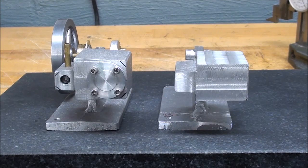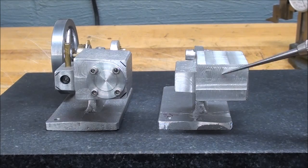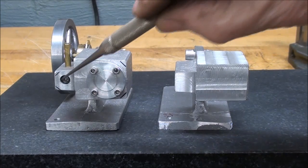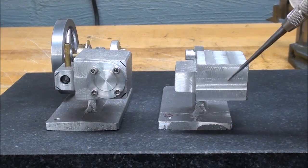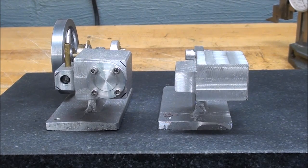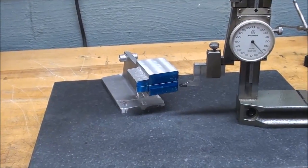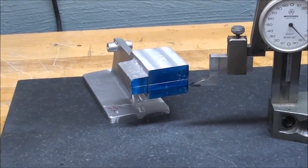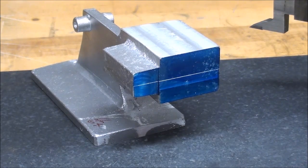I'm changing some of the dimensions just slightly over the original. This has a 5/8 bore, and this will have a 9/16 bore. This is a quarter-inch valve, and it'll remain quarter-inch. So now I'm going to put some layout die on the end here and lay out those holes to get ready to drill and ream. If at all possible, do much of your layout work on a surface plate with a surface gauge — it's certainly an accurate way to do it. So I just drew the center line across, and that'll be the center of both the bore and the valve.